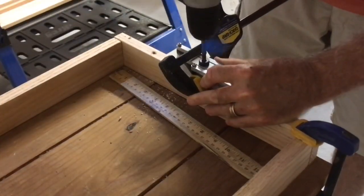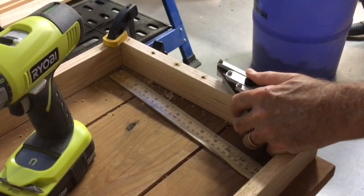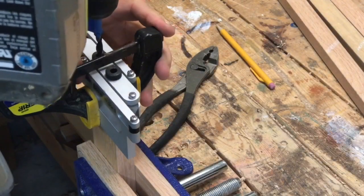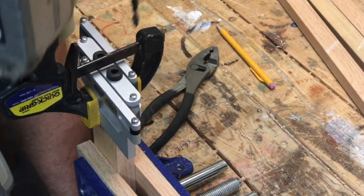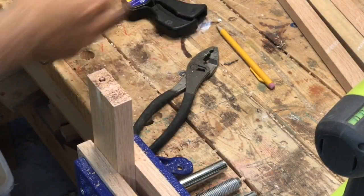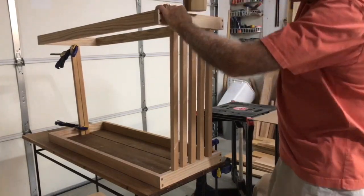For the slats I use a quarter-inch drill to cut the quarter-inch holes, which are smaller for the slats that are only one inch by three-quarters wide. The dowels in the end frame units are three-eighths inch dowels. I'm drilling quarter-inch sized dowels into the end of the slats, and because the dowel spacing in my dowel wizard is exactly one inch, I can drill two slats in one clamping since the slats are one inch wide. After all my slats are cut with dowels in them, I do a dry fit on one end to make sure I have the right length dowels, and I had to trim one or two to make sure they fit flush to the frame.